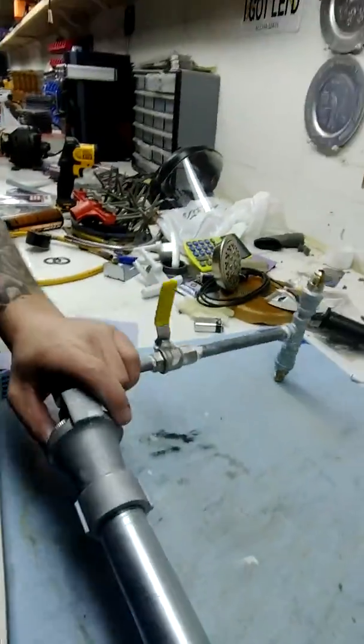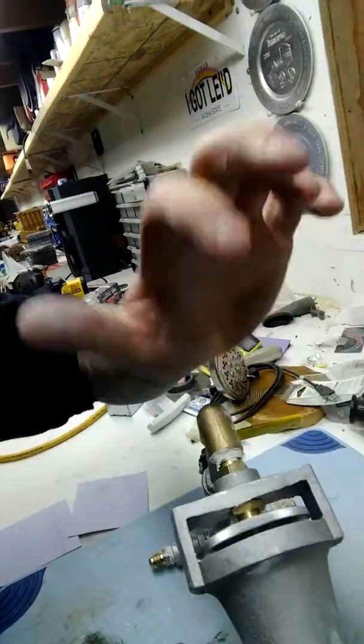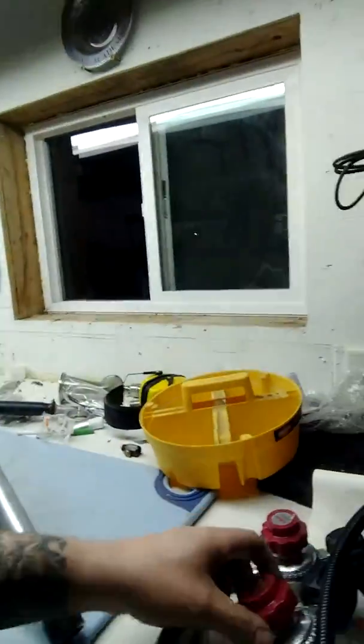This thing's pretty nice. It's very robustly built. I've watched Alec Steele on his YouTube channel multiple times, and he always likes it. I like the fact that it adjusts so nicely. You change the air control, and then I got these Kimbo 30 psi regulators. I'll turn the little knob here to adjust the pressure. From watching Alec use it, he says that this burner really likes pressure, so it's rated for 20. I figure 30, adjust and go as I can. But I'll show you Forge 2.0 here.